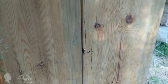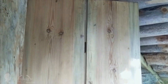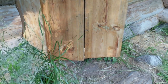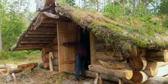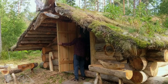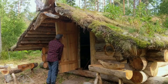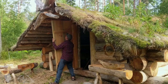When building the door, I knew the wide slabs would fully dry in a year, which would result in a gap widening, even though I hammered a spline between the slabs. This is why I installed dowels only on one end of the door's dovetailed rails. In order to take my pin-hinged door out for repair, I had to lift the door frame's header along with the whole roof using a post and two wedges. This roof-lifting procedure is not complicated — I have done it more than once when installing the door, and I even kept the original wedges.